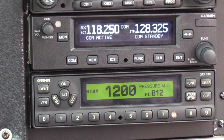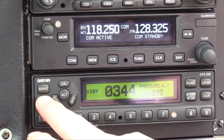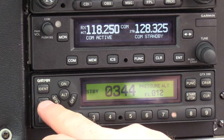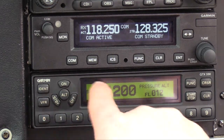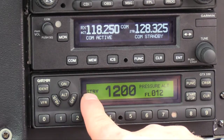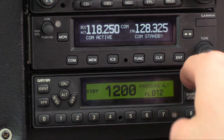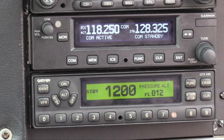This makes it very easy. On your checklist for startup you'll note that we're on standby mode and we are VFR. If you push that and you're on VFR it will revert to your previous squawk code, so make sure that you're on VFR — you can also just type in 1200. That is on standby mode; the Garmin transponder is turned on.